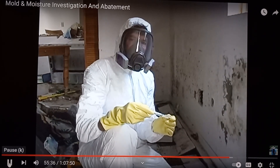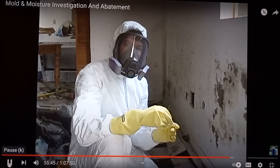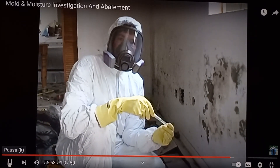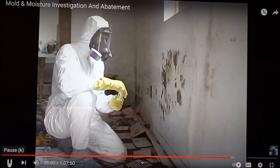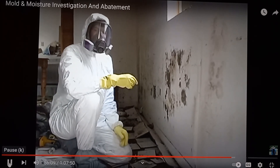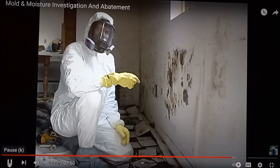Always use an indelible marker to mark your samples. The laboratory needs to know the size of the surface area that you swabbed so they can determine the spore count or density. The area sampled can be one square inch up to the size of a business card, and the laboratory will convert this into the measurements they need. Up until now I have been describing this as suspect mold growth. The way to conclusively determine if this is mold growth is to take a surface sample, send it to a laboratory, and have them analyze and confirm that it's mold colonization.